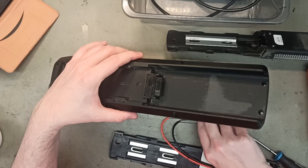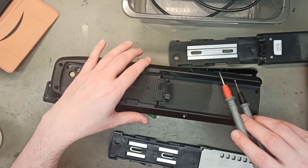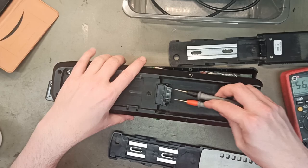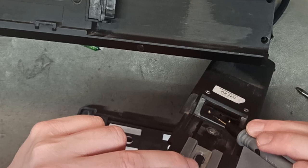Let's try the connector — this one seems a little deformed as well, not really high quality. Even all the way in, there's even what looks like a crack. So this connector has probably been very hot and the metal pins inside have melted away some of the plastic. But here we're getting the same 56.61 volts. These connectors do not look good — there is a lot of melting around the pins.